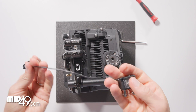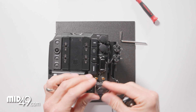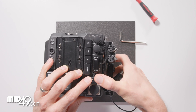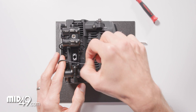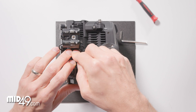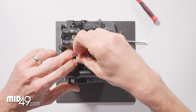Next we'll take our EB10, the DIN breakout, and align it with the connector on the back. We just want to keep that very parallel going into the connectors because these pins are tiny. Same idea — we'll leave one finger length of cable on the outside and loop this around, then out the mouse hole.